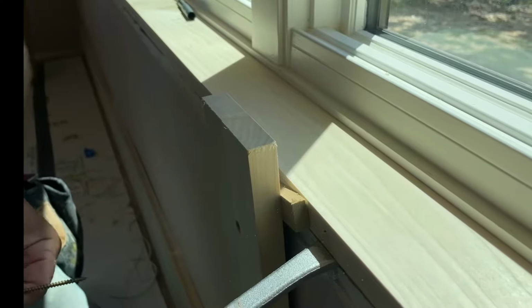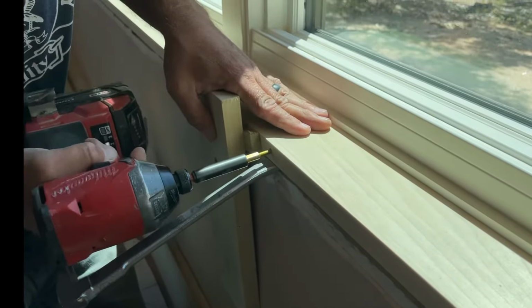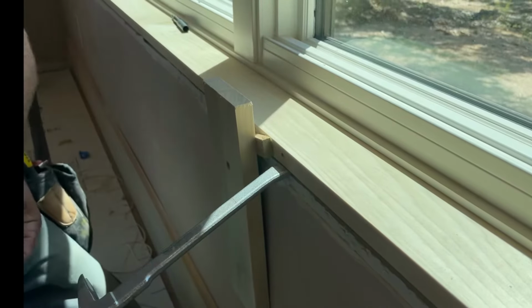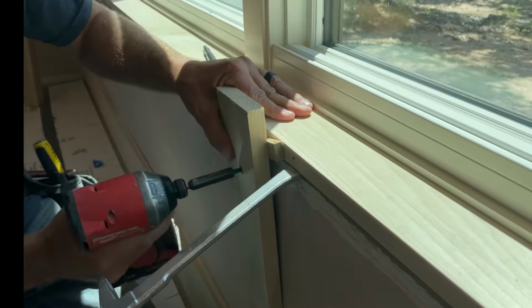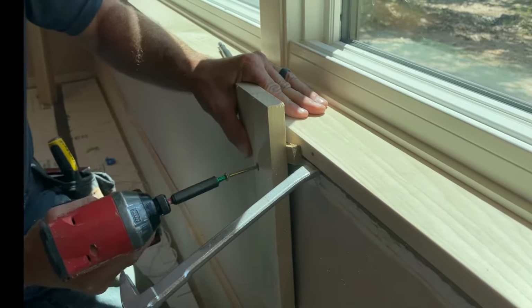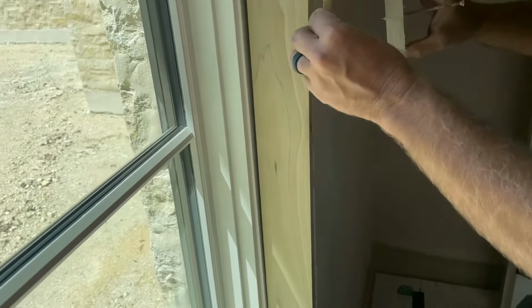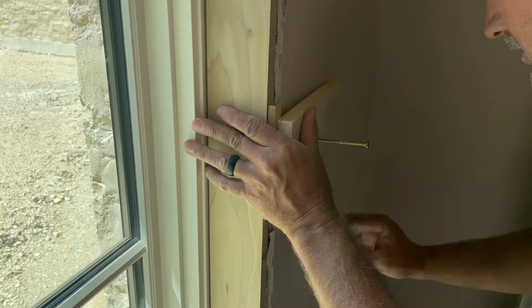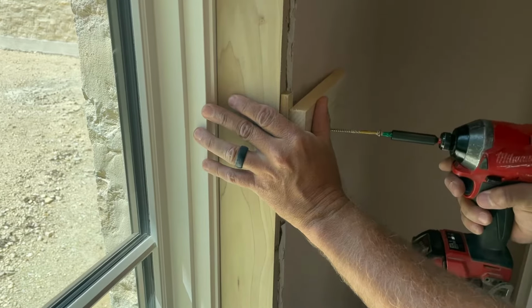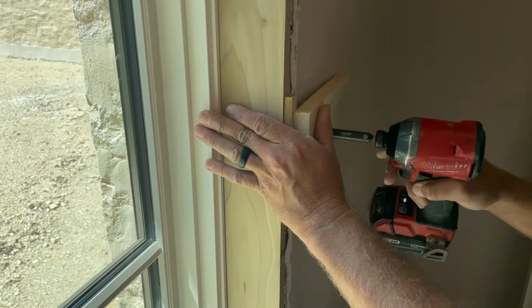And there's many practical purposes for a jamb like this, and one of the best benefits is not having to shim around the window. And sometimes, depending on the reveal that is desired by the client, putting shims around the window frame itself, dependent on the thickness of your material, won't actually fit in there. So then you're having to order or mill down material to a specific thickness to fit in there with the shims.